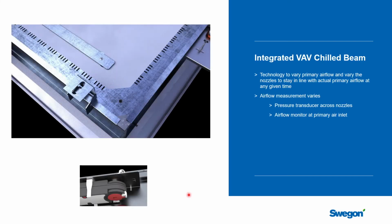In the last slide, we were looking at a VAV box installed in a branch duct that served a group of chilled beams. But you can also integrate the VAV function right into the beam. In this video, you can see the plate sliding back and forth, and it's doing 2 things. It is limiting the primary airflow into the beam, but it's also adjusting the amount of nozzles that are available. So it's synchronizing a change in the nozzle setting with the change in the primary airflow rate. And that allows the beam to have a much greater turn down range.